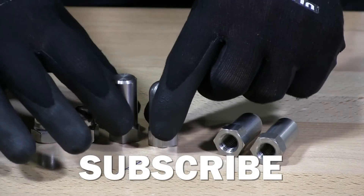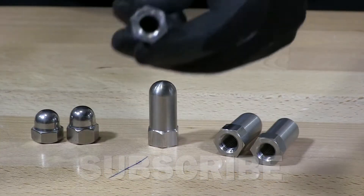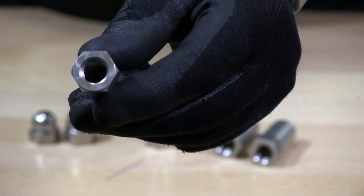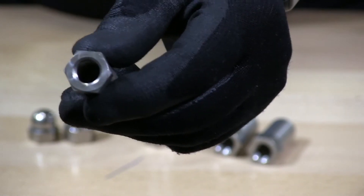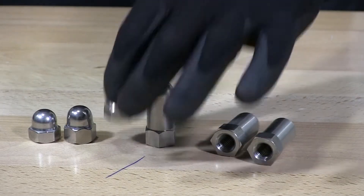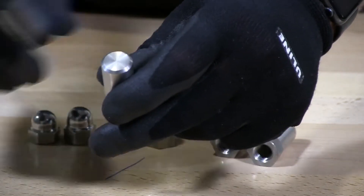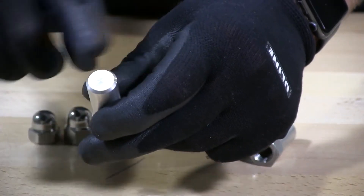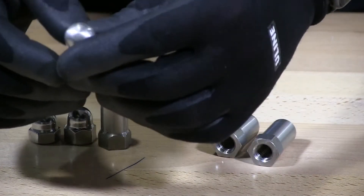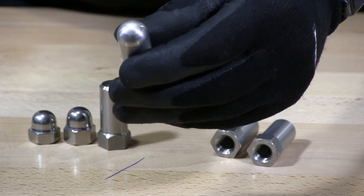The two tall come fully threaded all the way to the inside to the top, so you have full threads all the way through. On a two tall you have what they call a flat top — you can see the top is flat and it has a chamfered edge around it. And the rounded top is just rounded over like the standard cap nut at the top.